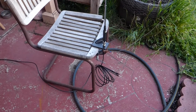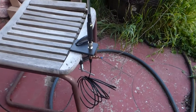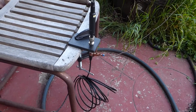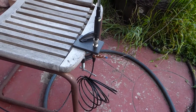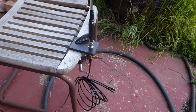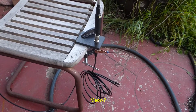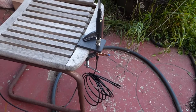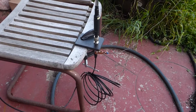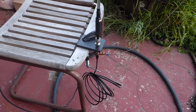Clipped onto the antenna is a wire that's 32 feet long. This one going out across the grass just above the ground seems to work best, but you can experiment with it. The bandwidth will be narrower or wider depending on whether the wire is on the ground or elevated above it.